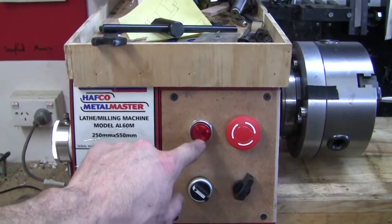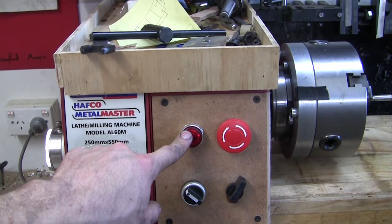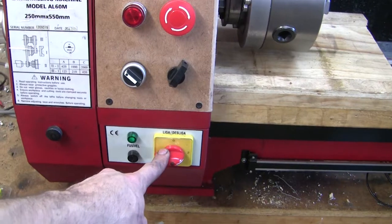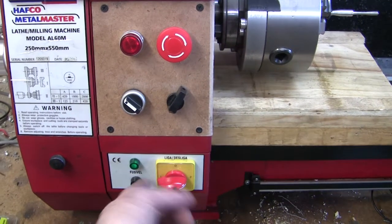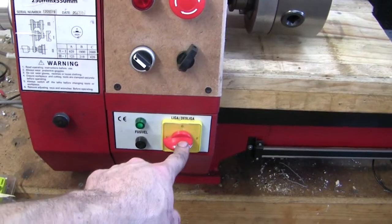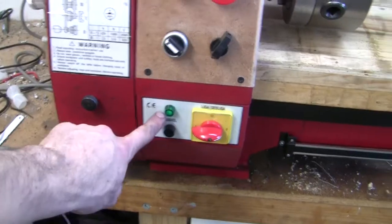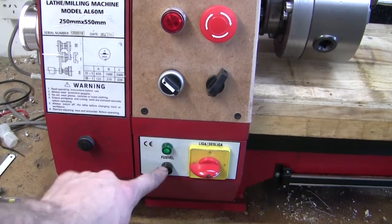The red one is my brake. I'm using two 500-watt halogen work-light globes as a brake. I'll have a photo of how they're mounted in the back. The switch that used to control this lathe — you can get it with a milling machine attachment — it used to put power to either the mill or the lathe, and off. I've rewired this so that it's forward, off, and reverse. The power indicator is on whenever the main power is turned on, and I've rewired the fuse in.